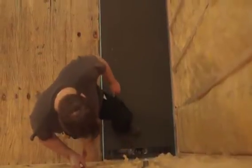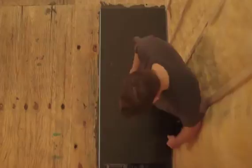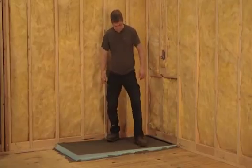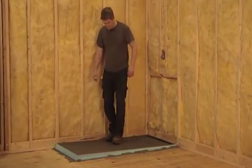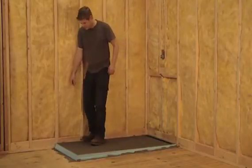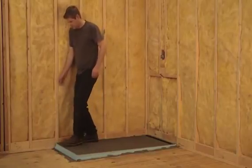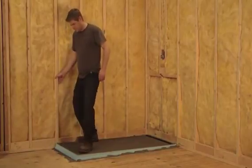Make sure all flat drain parts which come into contact with the floor or base are covered with mortar to avoid any hollow spots or areas with lack of adhesion in this connection and setting bed. The Rialito base is now laid into the mortar on the floor. Make sure no thinset mortar contaminates either the drain trap on the floor or the sealing gasket beneath the base.